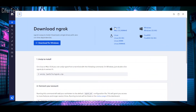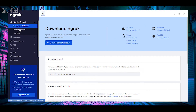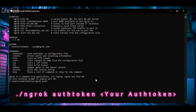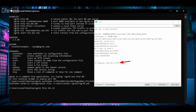For the next step, download the ngrok software for your operating system. In the left panel, copy your token key which we'll need next. Then type a few lines of commands to set up your security camera. The first command is: ngrok authtoken followed by your token key from the ngrok website. The second and final command is: ngrok http followed by your local IP, which you get from the serial monitor in Arduino IDE.